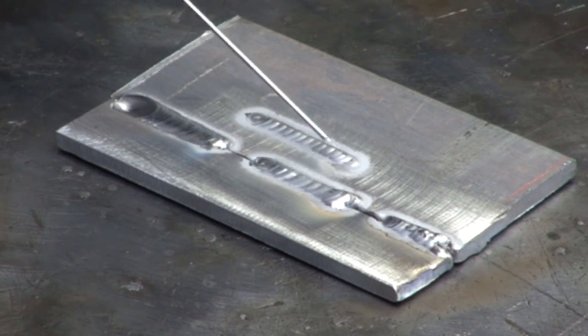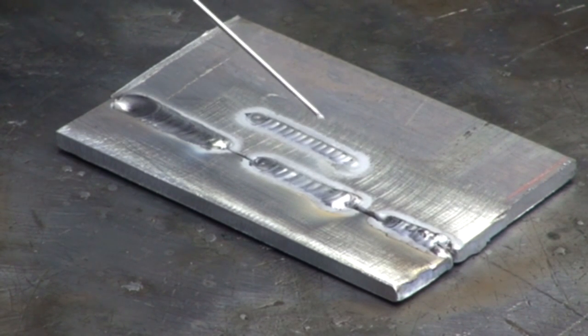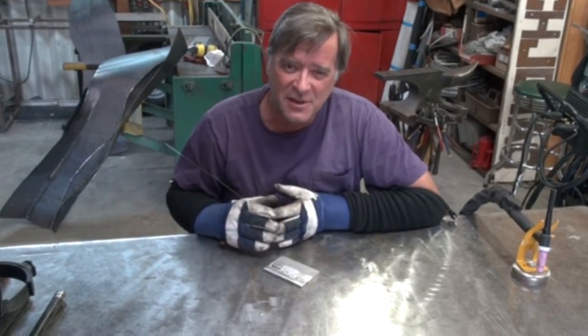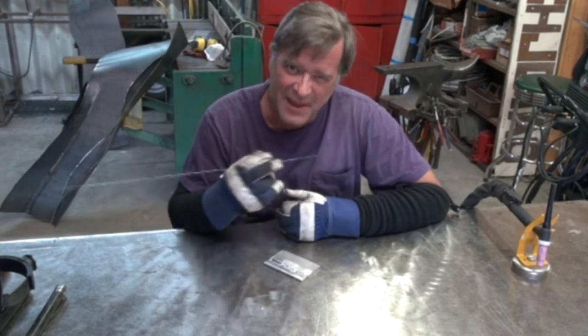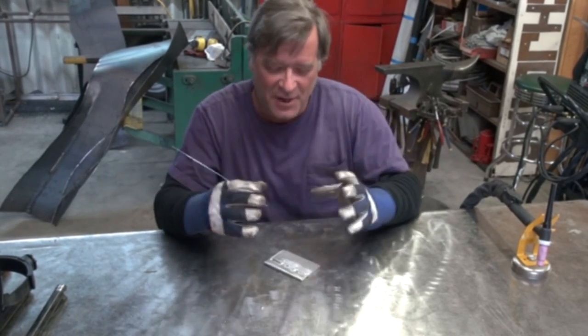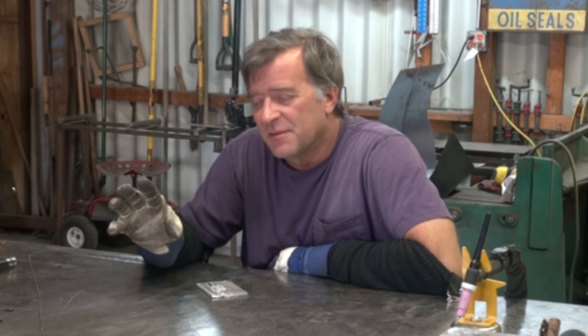And then for the last one was the triangular wave. Real quick, real sharp — on, off, on, off. It's a cool little function for working with the really thin metals, the verticals or something like that, working on an outside edge or a curve. I've really gotten the hang of that triangular. I like that from working on my little pieces. So that just gives you a quick look at what having the four different wave fronts can give you as far as variations when you're welding with aluminum.